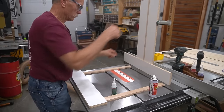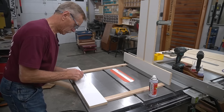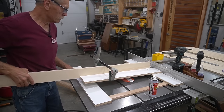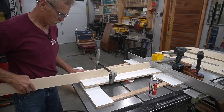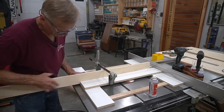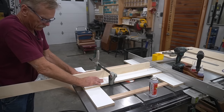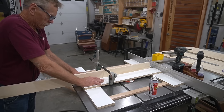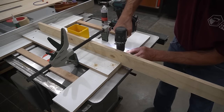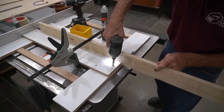The most important part of this fixture is the space between the two pieces and the fact that they're perpendicular to at least one edge. I add spacer blocks so that both sides of the fixture are perfectly parallel, and I apply a squeeze clamp to ensure the sides of the slot are parallel and correct for the thickness of the shelf material. I put accelerator on the upper pieces and CA glue on the bottom piece, then press together for a 10-second bond. Finally, I pilot, countersink, and drive four screws to hold everything securely together.